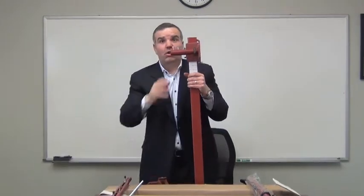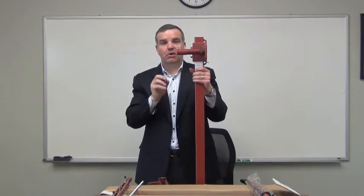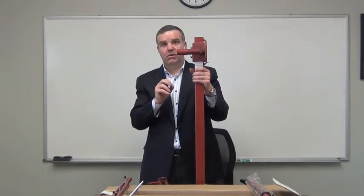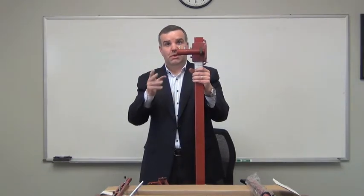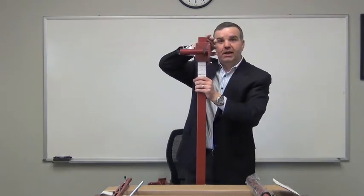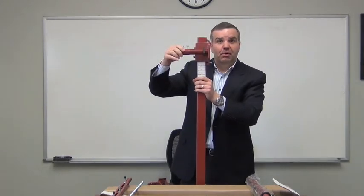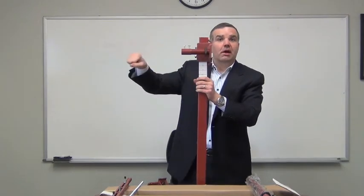The result of all of that is we only need one concealed arm lavatory carrier for most non-ADA fixtures because we have 3 stages of adjustment. The header bracket can be inverted, the nipple can go in and out of the header bracket, and the arm can go in and out of the nipple.